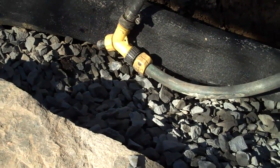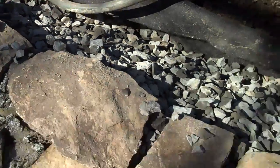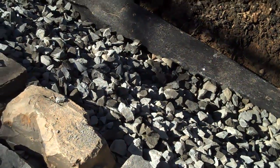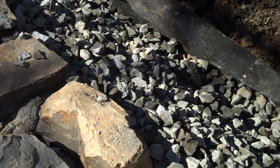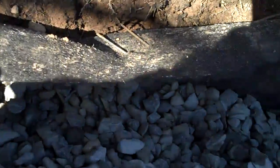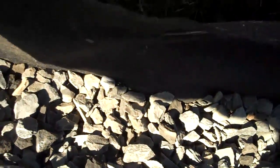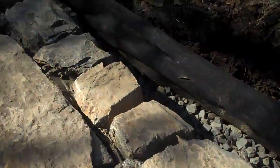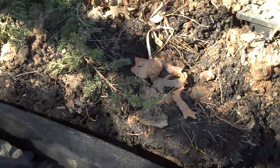At Chris Orser Landscaping, we take every precaution and every technique that you are supposed to take, and that is standard in doing this. There's also a layer of geotextile fabric here that separates the stone and the soil, and what that does is it eliminates any drainage stone from migrating into the soil.